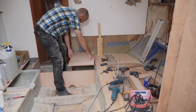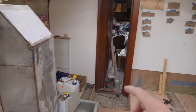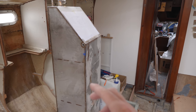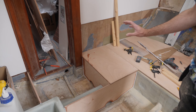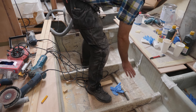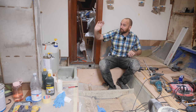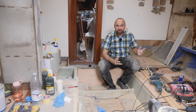On top of the supports is gonna be yet another little piece of plywood to form the cabin sole. I'm going to reuse this old water tank — it sits right there, so as soon as I've got the cabin sole in, I can put the water tank down, draw an outline of the settee I'm gonna build around it, and then move the water tank up to the workshop. Things are slowly starting to take shape and that has me very excited. I still have a lot of glass work to do — I still need to glass this section, this section, the middle of this section, and the entire section back there. Next week I'm gonna focus on getting this area done so I can move the water tank over.